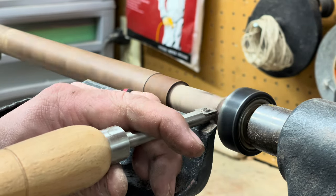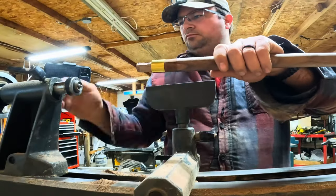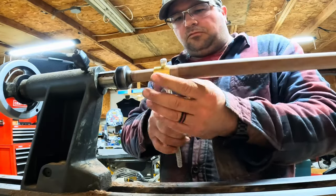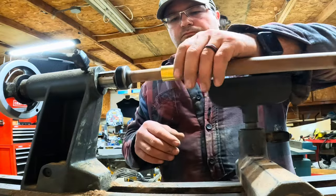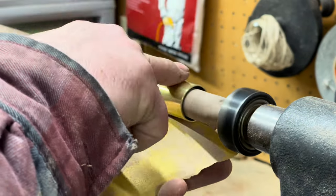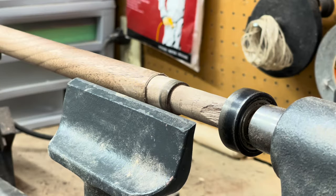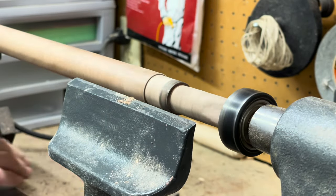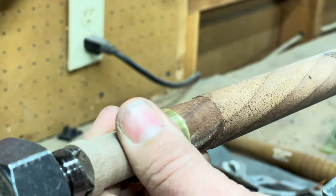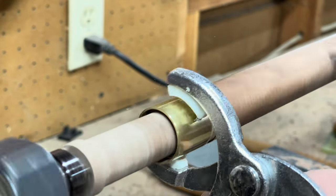There I had a little bit of tear-out; I repaired it off-camera with JB Weld putty, a two-part epoxy putty that's amazing. I cut three pieces of brass tubing — the third was for cutting. I take this little crescent wrench tool and push it on to cut most of the groove needed to fit the brass tubing, then repeat on the other side. Worked out really well — maybe that's a new technique.